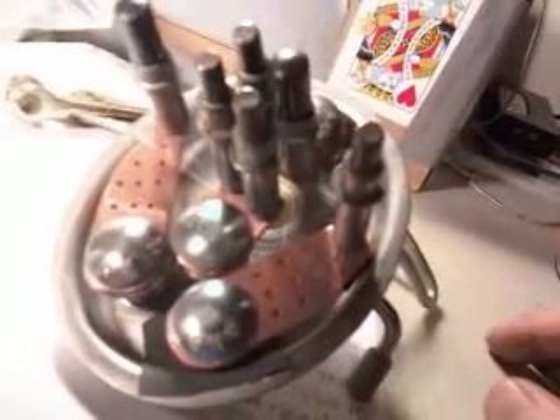What we're doing is joining all four of these buses together with a piece of plastic to keep them from rotating. If they rotate, they're going to touch, short off, cause an arc, and probably cause an explosion. We don't want that.